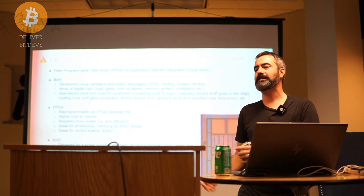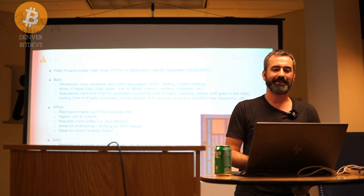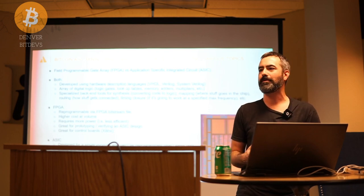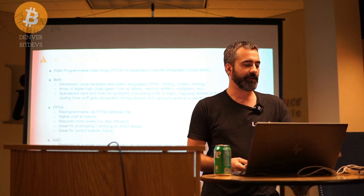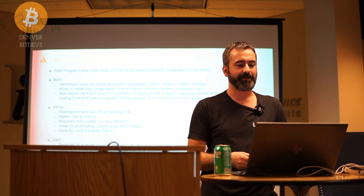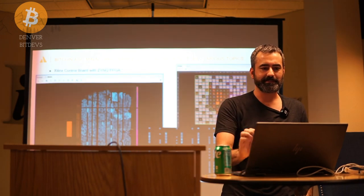The downside to an ASIC design is once you're done with the design, that's it, so don't mess up. It's a costly and timely design cycle. It takes way more engineering. But it is cheaper to build them at volume, a lot cheaper. All of our cell phones have ASICs in them. They require less power. That's the main thing. So they're great for hash boards for those reasons.